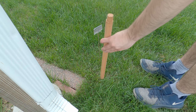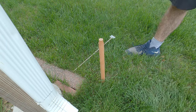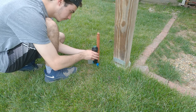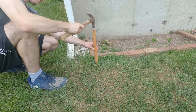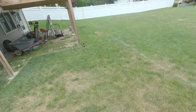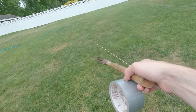Now time to remove my makeshift flags and hammer some wooden poles into the ground so I can attach the sprinkler heads and see if I need to tweak their position. With the first three sprinklers in their positions I wanted to connect these up and see what their range is on this setup and make adjustments if needed. Once these are all connected, tested, and repositioned if needed, the other three will be added and tested before completely burying zone 1.